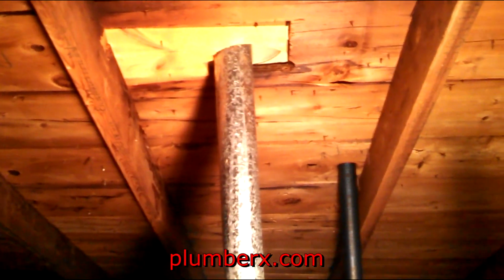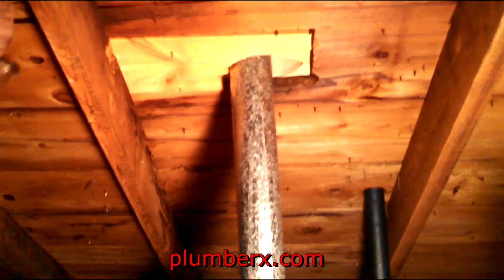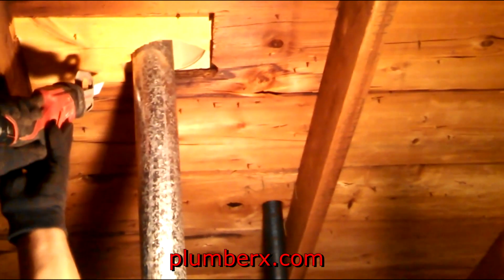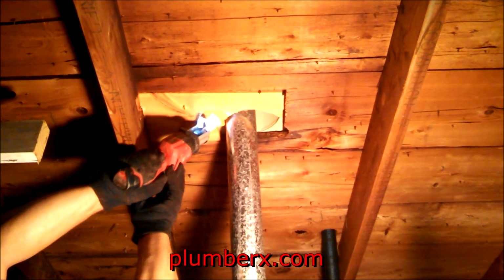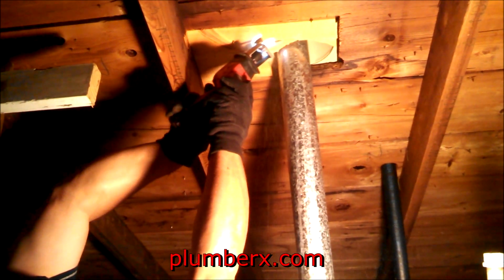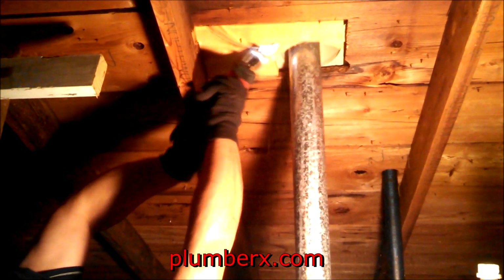Right around here. Of course, all this is coming out. So, you ready? I'm trying to get a cut. And as I was saying before, in the beginning of the video, when we were up here, the vent pipe, it is right now, it's touching that wood right there. So we're going to cut that wood away from that to make the clearance a little much better, because we don't want to transfer heat to the wood. And of course, this flue pipe is coming out. This is a single wall flue pipe, so it's even extra hot up here.